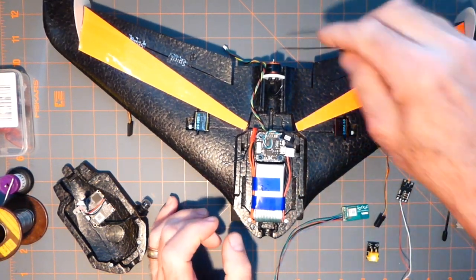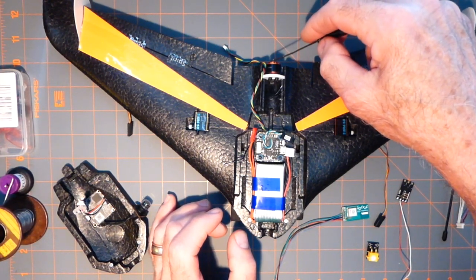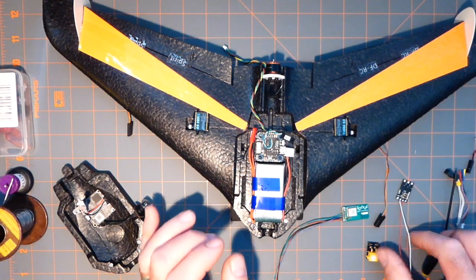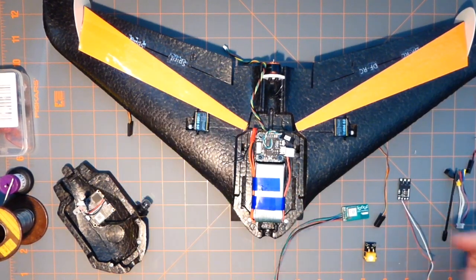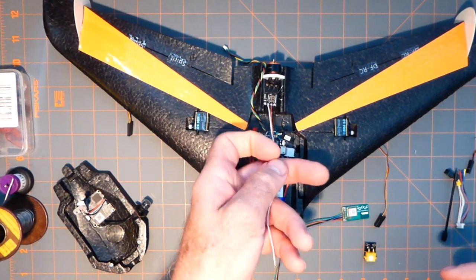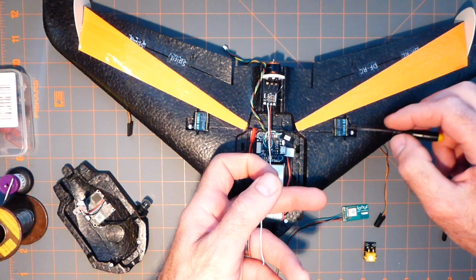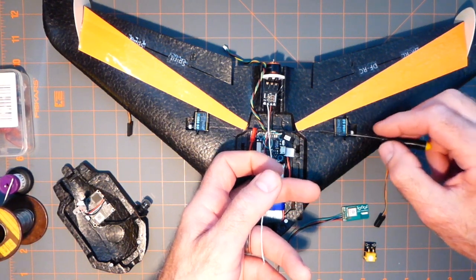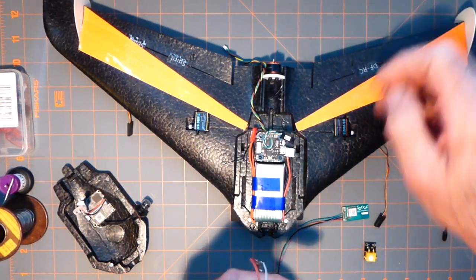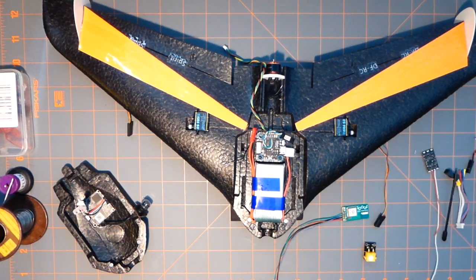So, and of course the propeller is going to be a certain amount of weight, plus there's going to be 2 metal screws. That's going to bring some weight back here. The speed controller, everything is in grams, you know, so it's going to make a difference. You may not think so, but it will. Weight adds up quickly. That's going to put some weight behind the CG, because the CG's around here, I would say, right this spar. Anything you put past there is going to be detrimental. So you want to try to avoid that as much as possible.